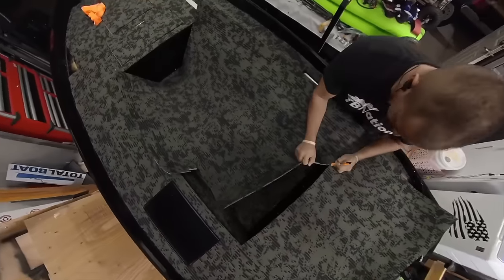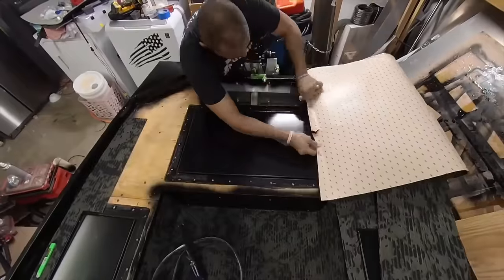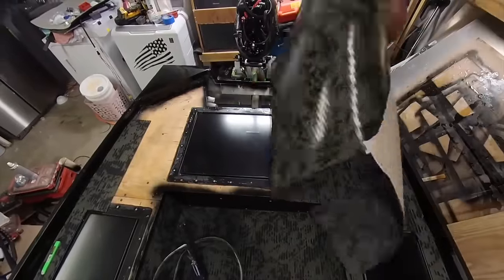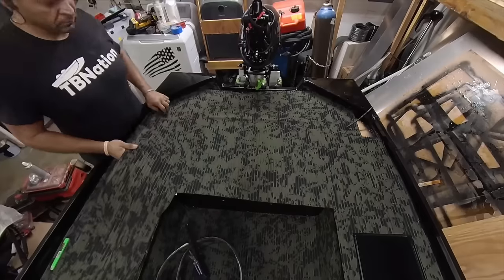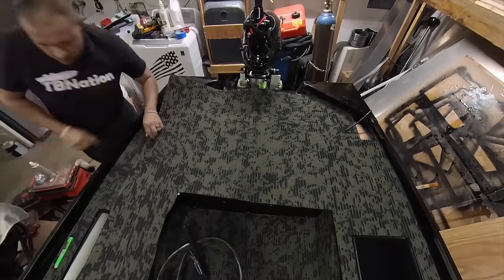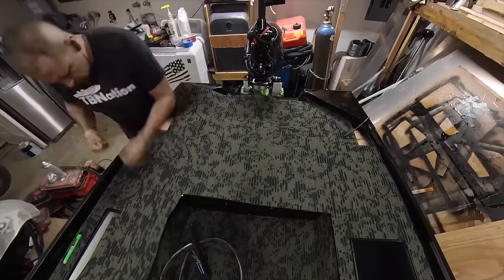Like right there, there's a little bit hanging over the hatch, just cut it out, throw it out. A lot of what you have here will not be usable after you've made cuts. So that's why you need extra sheets. If you have a boat like this that you think will be covered in roughly 2 to 3 sheets, get 4 sheets, or even 5 if you're just a little apprehensive.